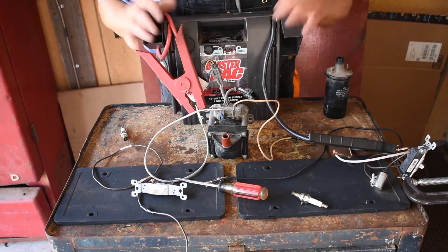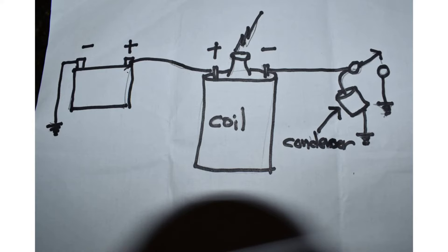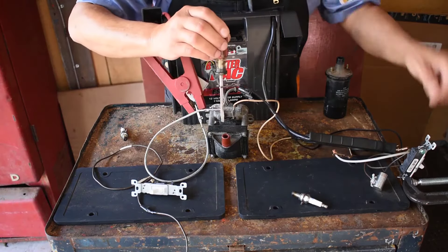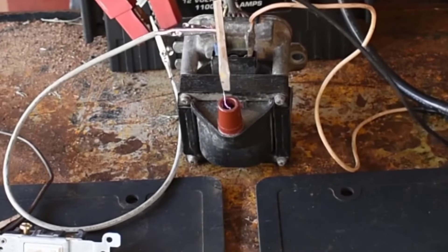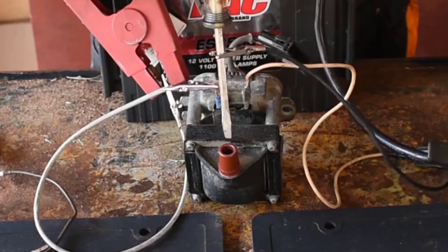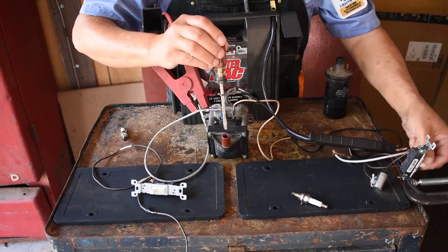So here we go. I've got 12 volts and this special switch hooked up with the condenser. I'll put the image of the diagram on screen — if you want to make one of these, I'll leave the image so you can get a shot of it and make your own coil tester. Let's see if this little guy works. I have to be careful because now we're working with thousands of volts. I think you can see it, and if I'm quiet for a minute, I bet you can hear it. That is at least 12,000 volts.